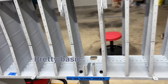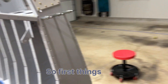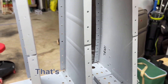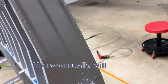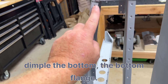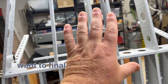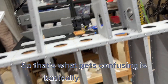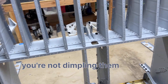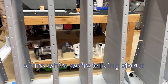It's pretty basic construction but very complicated regarding what to dimple and what not to dimple. There's a lot of confusion on this part right here — 1018 L and R. You will eventually dimple everything on the face of it, and eventually dimple the bottom flange, but right now you don't dimple the bottom flange until it's on, because you want to final-drill your bottom skin before you dimple. Everything on these bottom flanges will get dimpled and you'll come back through with your squeezer and dimple them later.